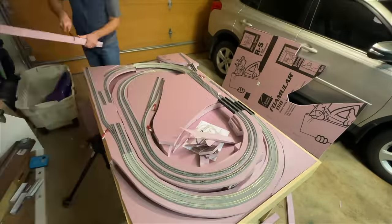But of course, those were on the inside and not the outside. So I had to go through and drill holes through the middle of all those black dots. So when I put the board back up in place, I'd be able to tell exactly where to put the screws and make sure they were going to go in safe locations, well away from all the wiring. Then it was really a matter of laying on my back and supporting the wood with my feet and hands and trying to get those first few screws in to help hold that board in place. But once I got the first few in, which was a little bit tricky, everything else went pretty smoothly. And now I have a nice bottom cover to the layout, as you can see.